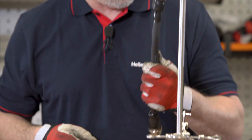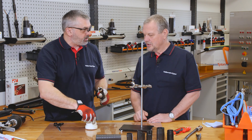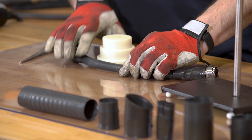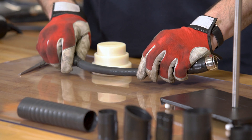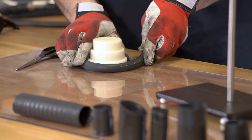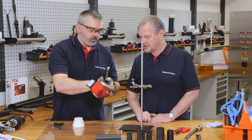While it's in this state now, it's set. We can do our standard bend test around a standard. The standard bend test is to make sure it doesn't crack at the joint — the diameter of the standard is six times the cable diameter, so you pick the right size for your cable. You just hold and bend. It's important to see that flow of adhesive around to make sure that when you do your bend test, there's no cracks.